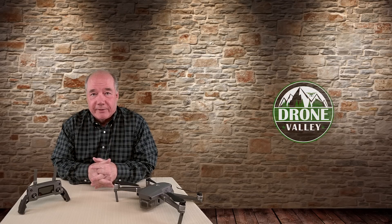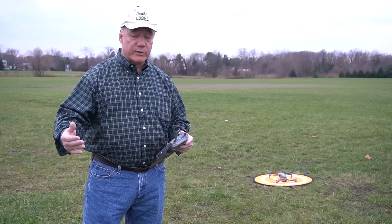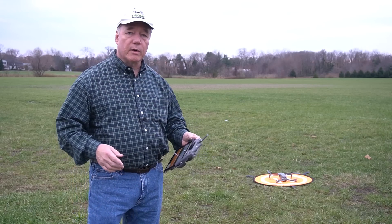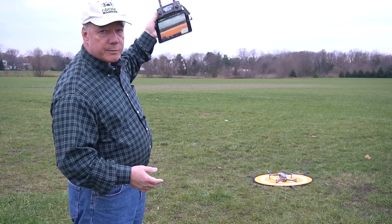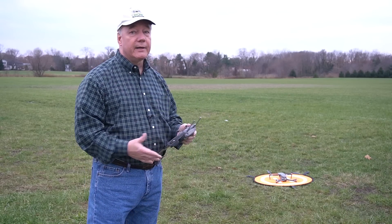Here's the test you've all been waiting for — Precision Landing on the Return to Home function on the brand new Mavic 2. It works on both the Zoom and the Pro; I'm showing it on the Pro. I know a lot of you were upset it wasn't there at launch, but I predicted DJI would add it in a future firmware update, and they did. I'll do auto takeoff, send it about 100 yards downfield, then hit Return to Home. I've set the RTH height at 30 meters, so I expect it to elevate, turn, fly back, hover over the target, then descend with minor adjustments to land exactly where it took off.